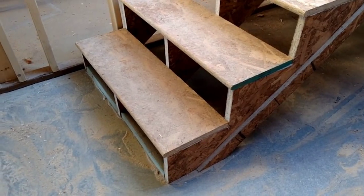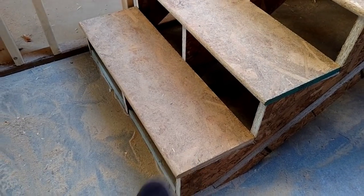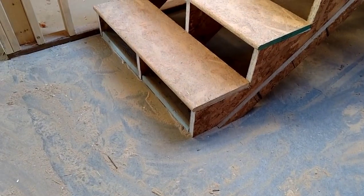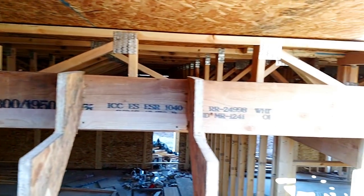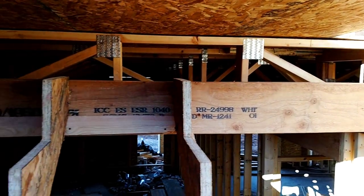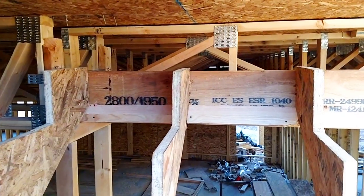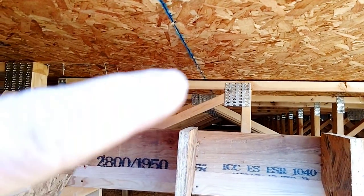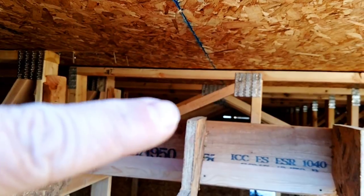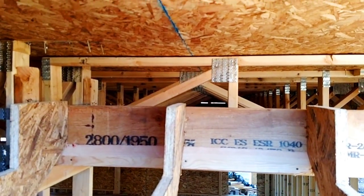Actually, I made a mistake — not 3/8 of an inch, it's an inch and an eighth. This tread is an inch and an eighth thick. The concrete has nothing on top of it, and there's a header board that the whole thing is resting on at the top. Same with this transition at the top: the distance from the top of the truss down to the top of the riser is going to be 3/8 of an inch taller than from the top of there to the top of there.